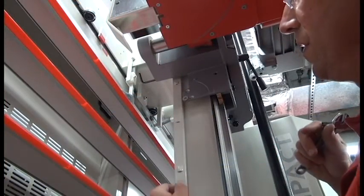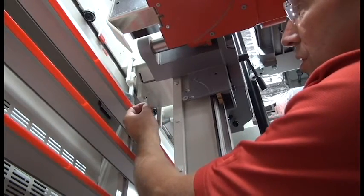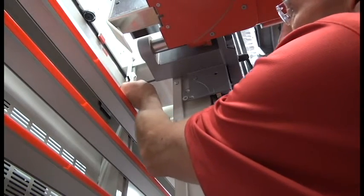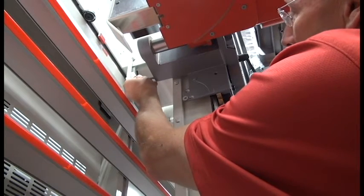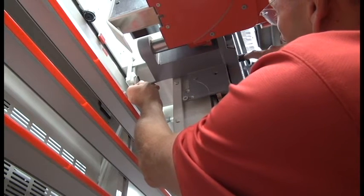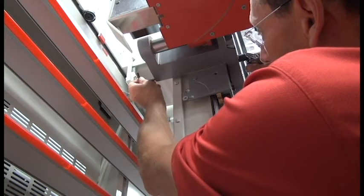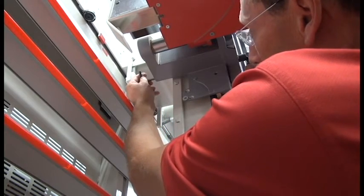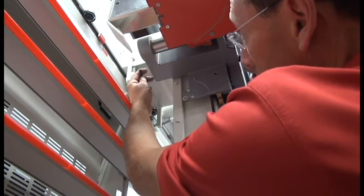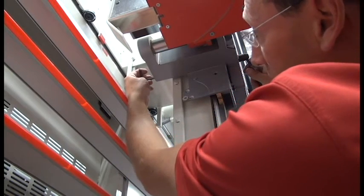Of course, you've noted that I've put the saw head in the vertical position to do this entire procedure. I've got my 6 millimeter Allen wrench here and I'm going to locate the screw by drawing a mental picture of the axis of the pivot point of the locking handle through to the back — that will be where my screw is. There, I can feel my 6 millimeter Allen wrench seated in the screw, and I'm going to turn it clockwise from behind, so as I'm looking at it, to the left.